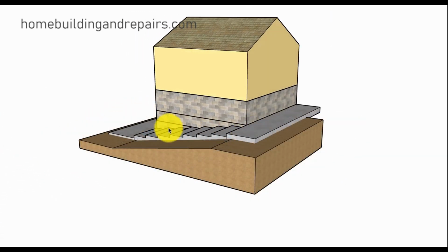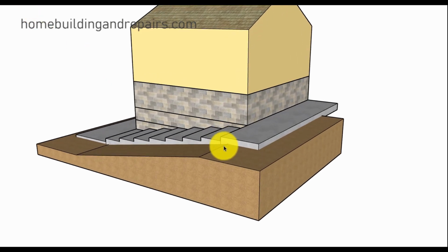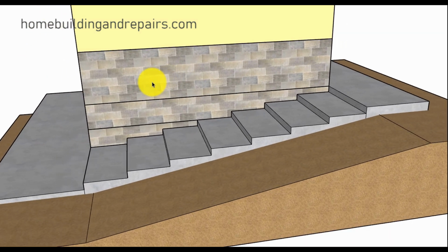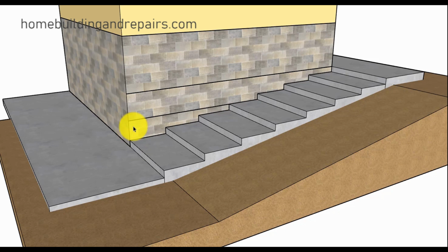In our second example, I'm going to raise it up to 4 feet, double the height of the sloping surface, and then simply do the same thing I did. So here you can see where we're starting with a riser here before we had a step that came out here a little further. So riser here, riser at the bottom. We're up 4 foot, 48 inches.